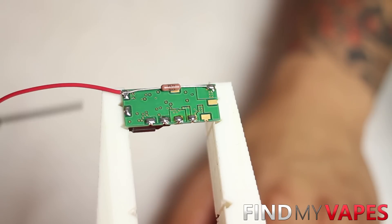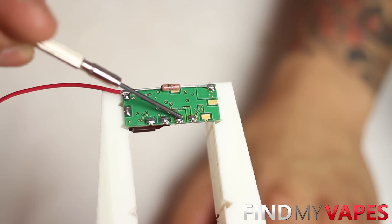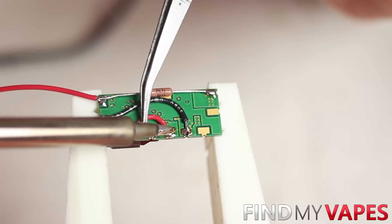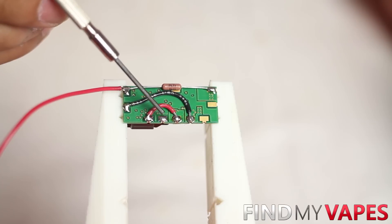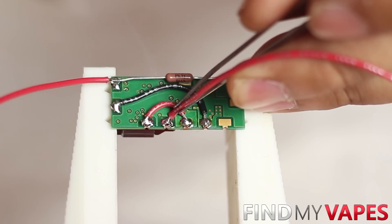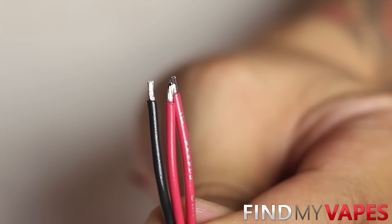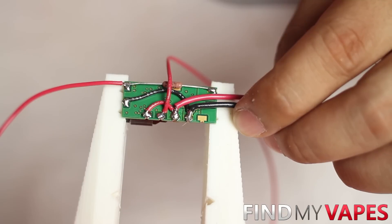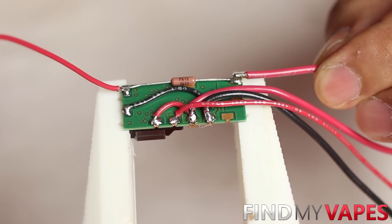Now move on to the sense pins. The negative sense pin connects to ground and the positive sense pin connects to voltage out. Next is the trim connection, which will be connected to our potentiometer — this is not carrying a high amp load, so use 24 gauge wire. The next few connections carry an amp load, so use thicker 18 gauge wire. First is the voltage out wire, which connects to the positive pin of the 510 connector. Next is the ground wire, which connects to the negative contact of the battery sled. Finally, we have the voltage in wire — this is how we power the unit with our batteries.